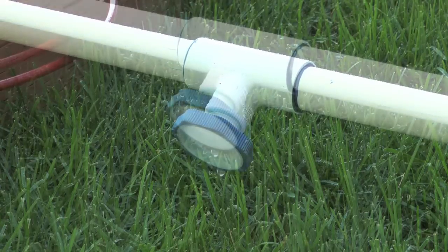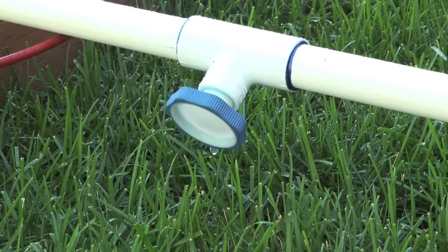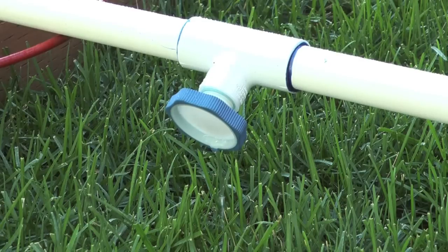The actual drain is a rubber diaphragm, and when pressure hits the drain it shuts off. And when the sprinkler zone shuts off, the drain opens up and starts to drain the sprinkler line, just like you see here.